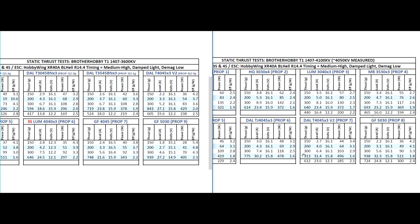On 3S it'll work, but still as you can see the thrust is very close — practically identical to the 3600 — but it's using a little bit more overall power: 285W versus 238W, so that's actually a lot closer on 3S.